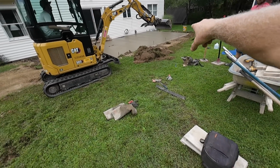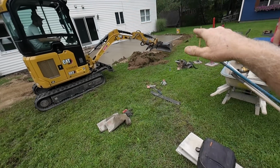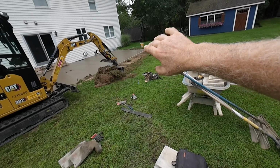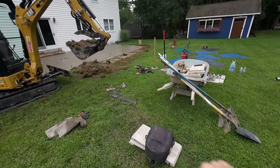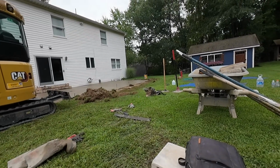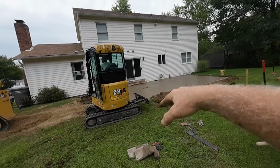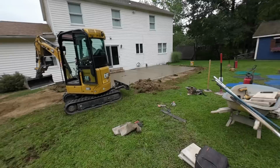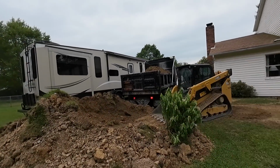Tom's just cutting the sod back. We're going to do a taper down to that. The patio has some fallout as well as some fall to that low corner. The homeowner may have to cut some of that dirt down, but it looks like a pretty nice match to the yard. It might just be ever so slightly low, but we needed 2 steps down and we needed our slope away, so that is correctable. Loading this dirt out, the neighbor's taking it, so we brought the truck back.